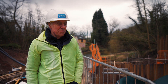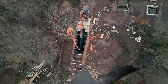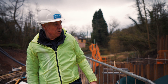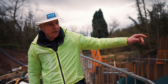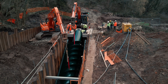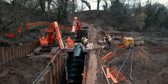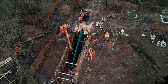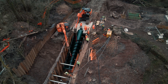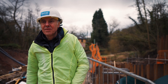After that we'll be able to turn the screw manually and confirm everything's lined up, and then we're ready for the next phase: building a powerhouse structure on top of this slab, and then putting the electrical equipment in. At the end of the shaft at the top of the Archimedes screw there'll be a gearbox coupled to an asynchronous electrical generator, with a control cabinet in the back of the powerhouse controlling the generator speed. We'll then connect a large electrical cable running from the bottom right-hand corner of this slab back into the factory at Siemens on Eaton Bank estate, and we'll be ready to start generating.